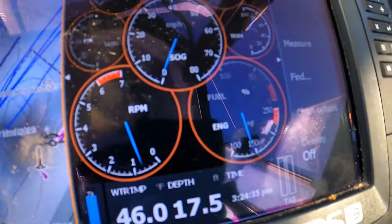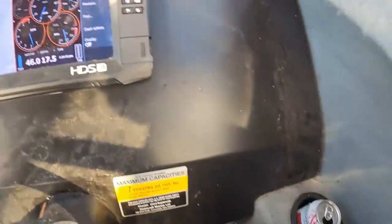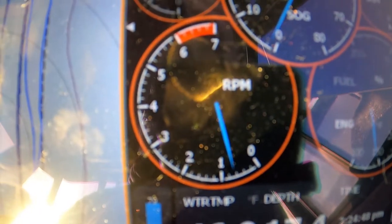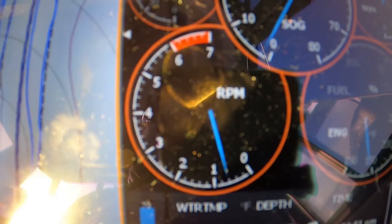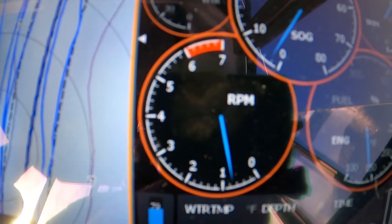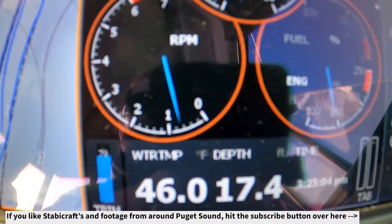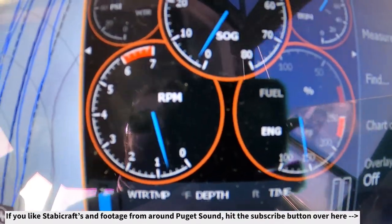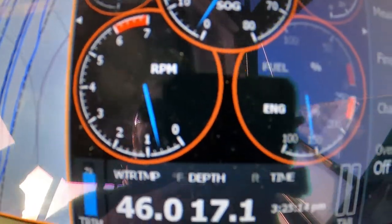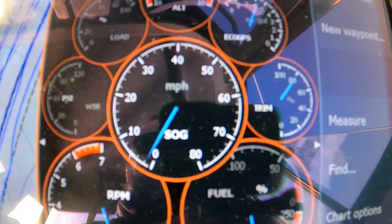So, we are now currently trolling, and I'm going to hit the downward button here. It'll come back up. Now, I'm going to throttle forward. You can see it's dropped down to about 600 RPM. It's holding there — that's about as slow as it'll get. And if you look here, speed on ground off GPS is running right at 2 miles an hour.